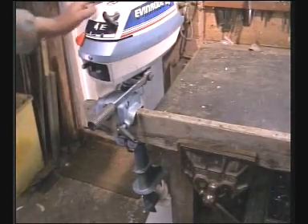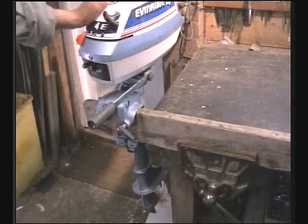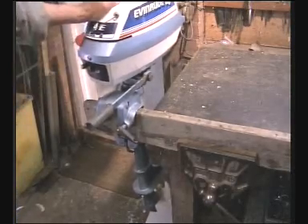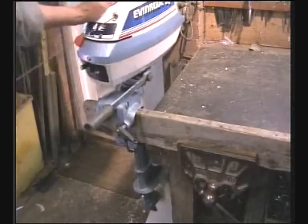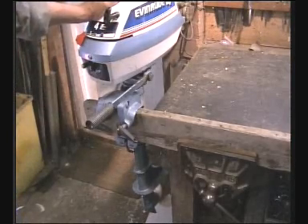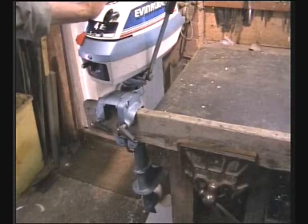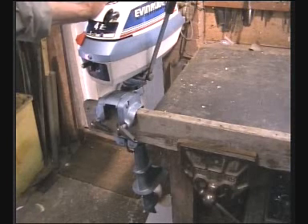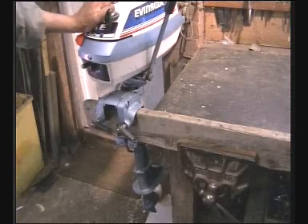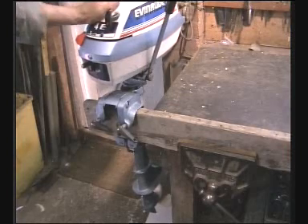I've reassembled it — very simple job. And now it works absolutely fine. It's in no drive at the moment; if I pull the thing over, the collar does one turn but that's about it. If I just click it into drive, as you can see, we now have full drive. So a very simple fix. There you are, Dave — it didn't go because you didn't have any oil in it. So once a year, put some oil in it. I put in EP 140, I think. So you owe me a small bottle of EP 140 — and how about a nice bottle of red to keep it company? This is officially on YouTube, so you've got to own up to it.